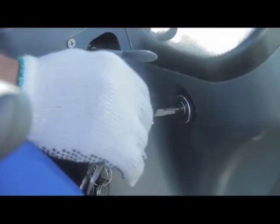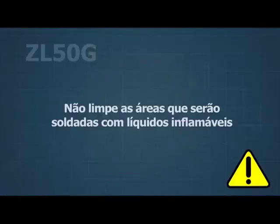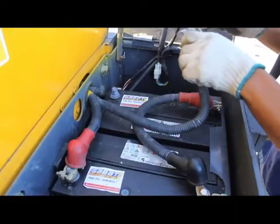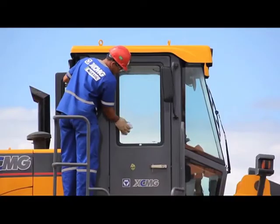Turn off the engine for diesel refueling and do not smoke near the site. Before welding, clean the surface with a non-flammable product and turn off the central battery system. Never undertake electric welding or flame cutting on tubes containing flammable liquid. Keep the equipment clean at all times.